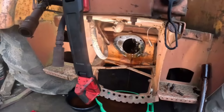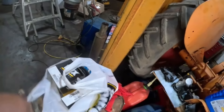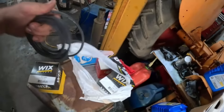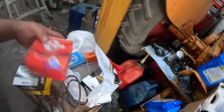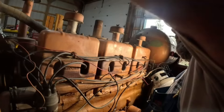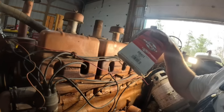In the meantime, I did go get some more parts. I got my WIX filters — part number 51189, times two. I bought some more spark plug wire so I can make appropriate-size spark plug wires. There's my new cap — so I think what we'll do right now is change out the cap. It's a DR413 in the standard version.